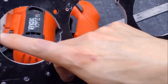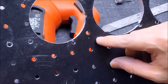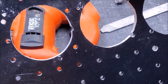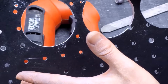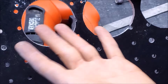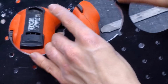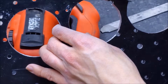At this point, I am going to drill out the corners where I center punched earlier, and then I'll go through and I'll tap each one of those 4 corners for the screws. I think I'm going to use 6-32 screws on here. It's going to be a project that has a bunch of standard American size and then a whole metric size. I prefer metric because I'm used to a base 10 system for reasons. 2 of them, actually. But yeah, so I'm going to go ahead and do that.